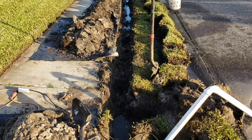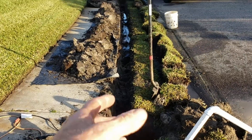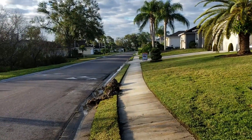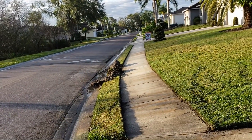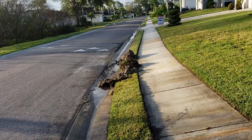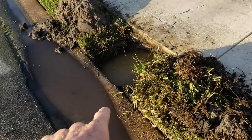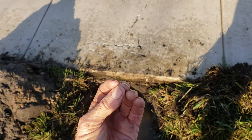We've dug a couple holes. I did find what we call a curb drain — there's a four-inch perforated pipe surrounded by gravel that did run through here, and of course that is collapsed and broken. You'd say, why don't you just fix that? Well, that curb drain runs the length of the street, and we could do that if the association wanted to pay for it — we'd replace all this line. We actually dug a couple holes over here to make sure. We found the pipe here and over here, and again it's just collapsed right here, probably from day one when they put it in.